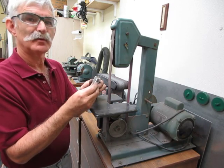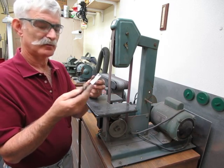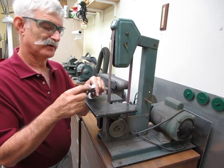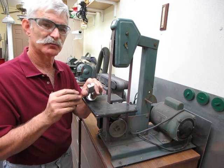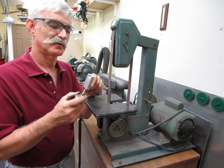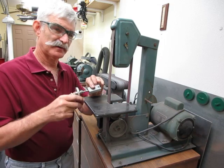I did it such that the entire hole was enclosed by metal, and then after the hole was drilled I milled this face down to the centerline of the hole. If you try to do the drilling too close to the end it's going to break out and probably make a mess, so I drill first.